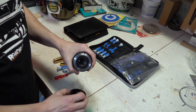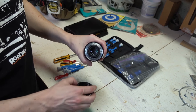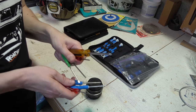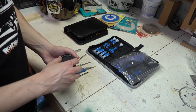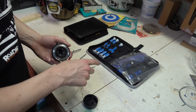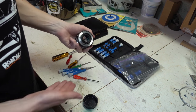The most difficult part is to remove the screws on the back of this plate that holds the aperture ring into place. This is my third lens that I've converted. The previous two I had difficulties removing the screws. My advice would be to have lots of screwdrivers to try. Several are very similar in size but just didn't get in the screw perfectly to break the thread locker on the back of all screws. For this lens, this cheap screwdriver that I got for replacing my cell phone battery ended up working.